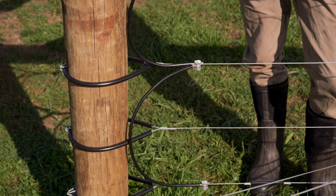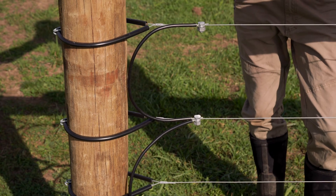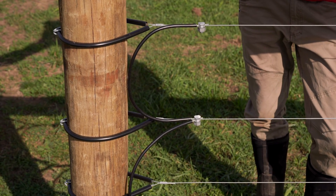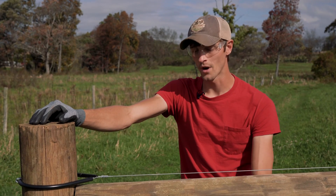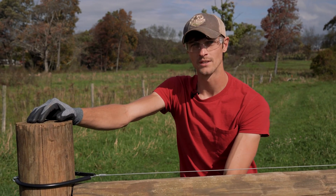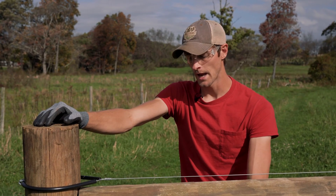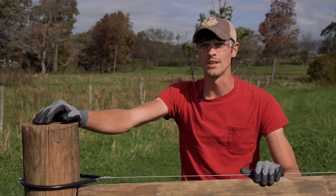We chose to put our jumpers on the outside of the fence. This minimizes the chance of any animal interacting with it or potentially pulling it out of a split bolt. You can make these jumper connections more permanent using crimp sleeves, but one of the nice things about split bolts is that they're flexible — you can undo them, reconfigure which wire goes where, and it may also help you as you're troubleshooting to be able to eliminate or isolate wires.